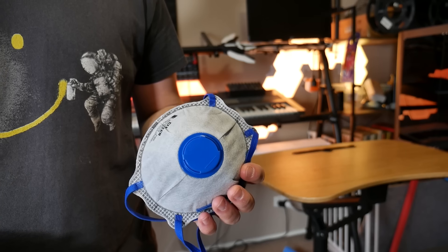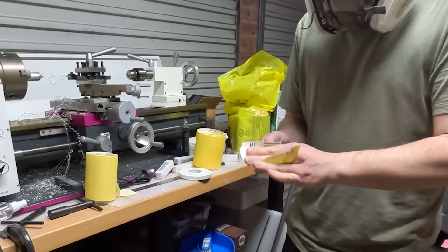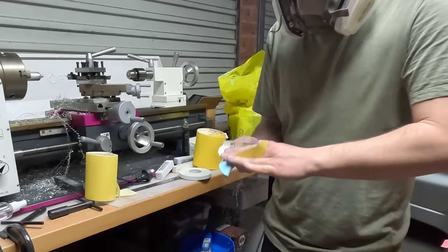At a bare minimum, you need some sort of respirator or mask. I also highly recommend a full face goggle — not just safety glasses — because when you're sanding, fine microplastics go everywhere and can easily get underneath goggles and into your eyes. I like goggles with a silicone edge to make sure your eyes are protected. At a bare minimum, you need face protection and a respirator, because you don't want to be breathing in fine paint dust or plastic dust.